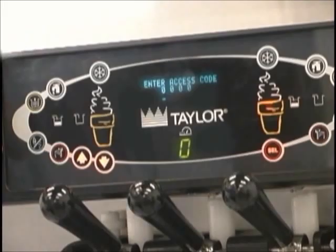In the menu program, the arrow symbols and the select symbol function as menu keys. The up arrow increases the value above the cursor and scrolls upward in text displays. Select advances the cursor position to the right and is used to select menu options.